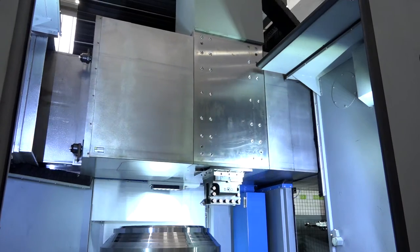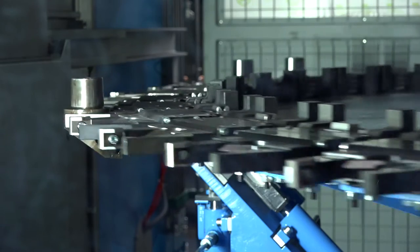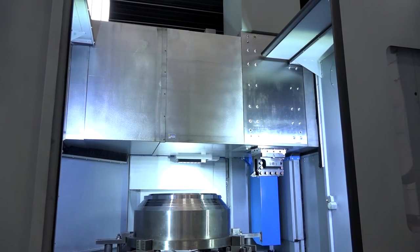We spoke earlier about build quality and accuracy — that is a key characteristic. When I look at this tool changer, there's lots of flexibility in the heads and tools you can change, but it doesn't look that fast. Is speed not important? Not really. Flexibility is what you're after — if you can do as many operations in one setup, a few extra minutes for head changes and tool changes is irrelevant. It's the performance of the machine that counts.